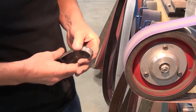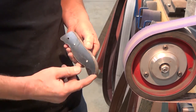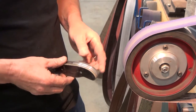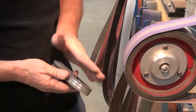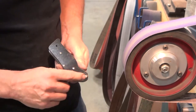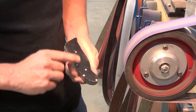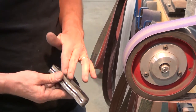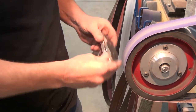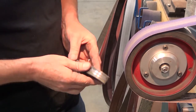All right, that's all flush. Now, this will ease all the way around. We'll use a couple different grinding attachments and a slack wheel mostly, and we're just gonna round that over. Now, we'll probably take that off because we'll run in and grind off those screws. We don't wanna do that. So we'll take these off and finish and start rounding these over on the grinder doing this and get a nice rounded over effect that way.